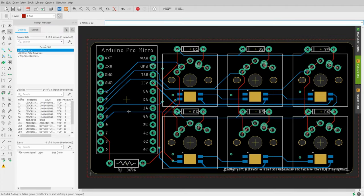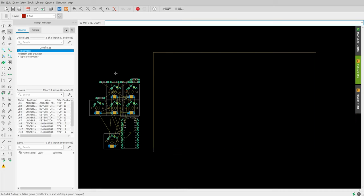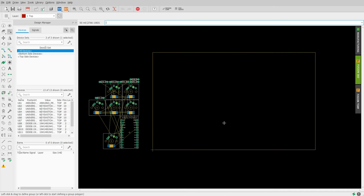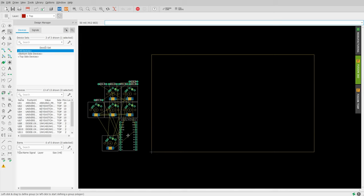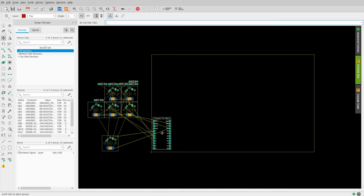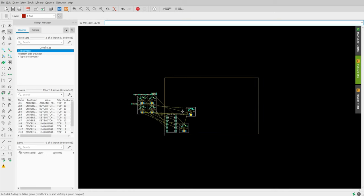This is the finished PCB, but I want to quickly give you some pointers on how to get started. After drawing the schematic, click this button to switch to the board view — if you haven't created a file yet it will create one for you. This is how it looks when you first switch over: the yellow outline is just a suggestion, and all your components appear on the side. Your first step is to arrange all of them by clicking and dragging. These little yellow lines represent connections between components.